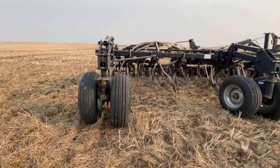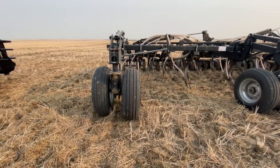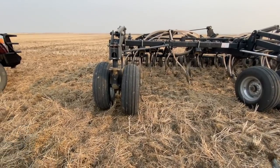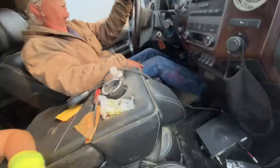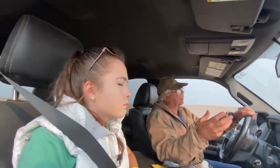When you stop the air from coming out of the boots, it keeps dumping into the hose and can't get out, fills up the hose, and nothing comes out. It's going to have happened way back - I just hope it only happened down here. I never shut the fan off though, it was always running. But if you plug the boots and it can't push air out anymore, then it can't move seed - the seed keeps coming in until it fills up the tube. We're going to go get the little motor, find the vacuum, get some long hose, tape on it - 40 feet. The concern is plowing up good wheat, but this wheat isn't growing yet. The problem is we don't know when it happened.